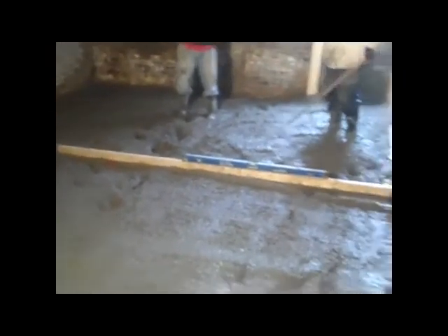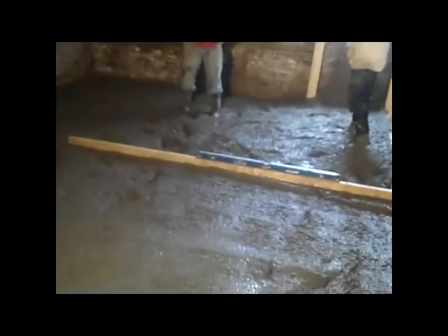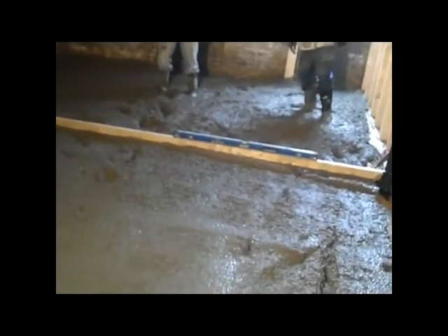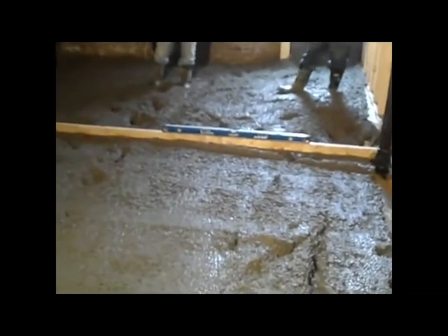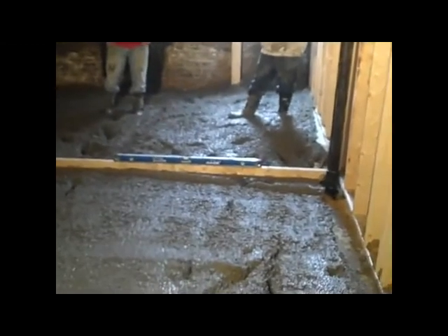Now that we've filled the basement with wet cement, the more difficult job comes with leveling everything off and making it smooth. This long 2x4x10 board will be used as a method to level it up by pulling it across the wet concrete, which will leave us a smoother surface. The level is on there — we're trying to make this level and making sure the concrete slopes into the drain.